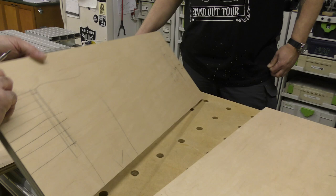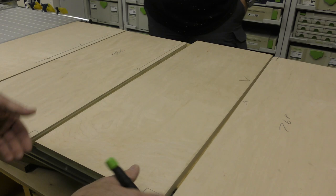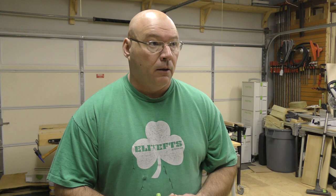We're going to do what's known as a captured back. This is the front, so I orientate everything and make a line — that's where my back is going to go. I'll also say this every time: we grabbed that piece of plywood, hauled it in, ripped it, set up the MFT, cross-cut it, edge-banded it, guillotined it, and trimmed the edge band. You have a lot of time into this cabinet already with still four pieces of plywood — always label everything.